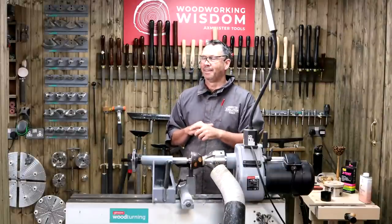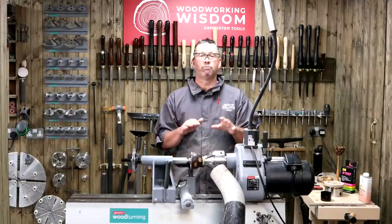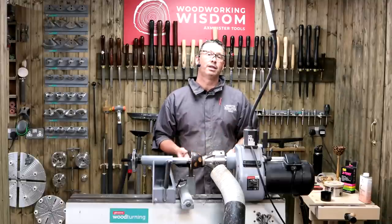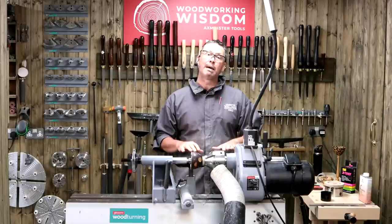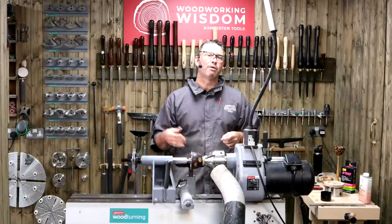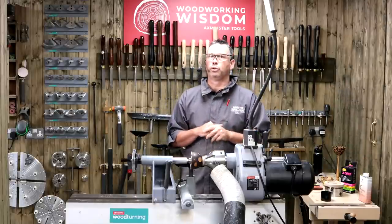Yes. And then we've got one from Malcolm here. Is the sealing coat the same resin? Yeah, it is exactly the same resin, no difference. And if you're doing bigger pours, you always put a sealing coat on to seal the grain in, to stop those air bubbles coming away from the timber as it soaks in. So you do that first stage, 24 hours, then do your main pour, your first of two or three pours, depending on what you're doing, you know.